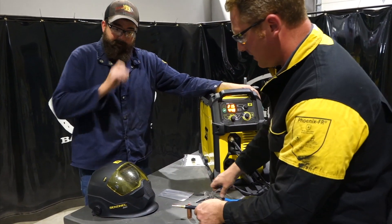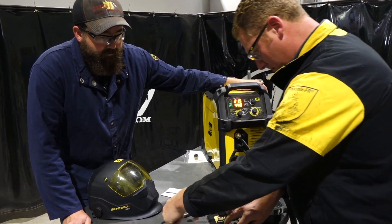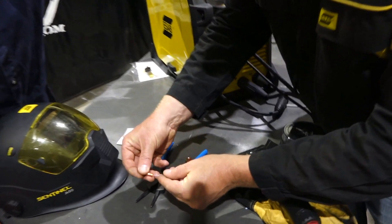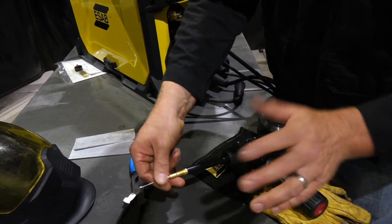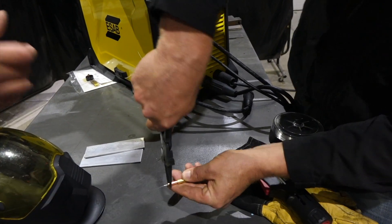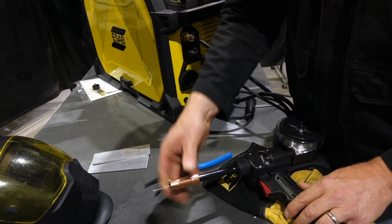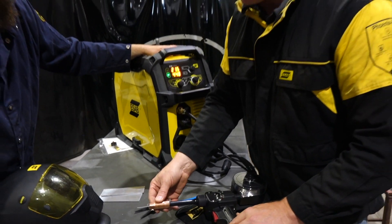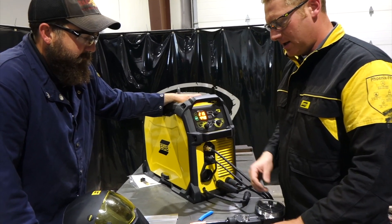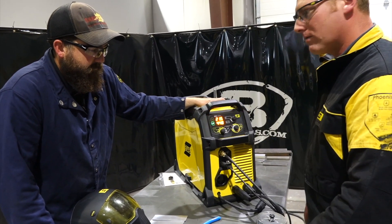Let's take this tip off just in case. Sometimes it goes really good; other times I've had a little bit of a struggle, but you shouldn't struggle too much. The biggest thing is you straighten that wire out — you gave it a good three inches of straightness so it can feed properly. You saw I used the pliers on the contact tip — just give it a little tweak. You don't want to wrench on it and crank it down too tight, because you could strip out threads — it's brass and copper, pretty soft materials. With that, we're ready to weld.